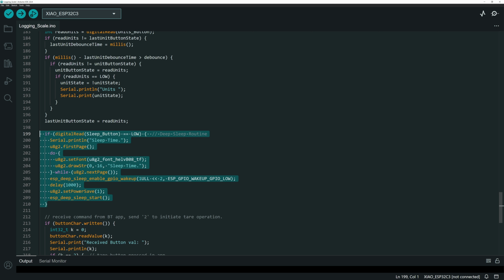This is why I thought that I had a problem with the input pull-up resistor that is internal, because it just wouldn't work. And I was looking at the code, and I was looking at all their documentation, and everything said that my code was right. Like I couldn't find any errors at all. And I did all kinds of things. I'm not going to go through all the different ways I tried to debug this thing, but I had no idea what was going on. And then randomly on Reddit, I found a comment that somebody was talking about this. They're like, oh, I put a delay in and it worked. And I tried it, and boom, it just perfectly worked after that. It was infuriating. But that's all you need to do.